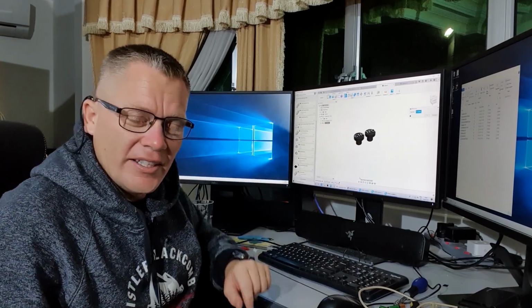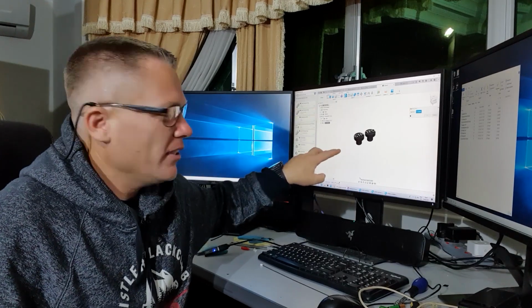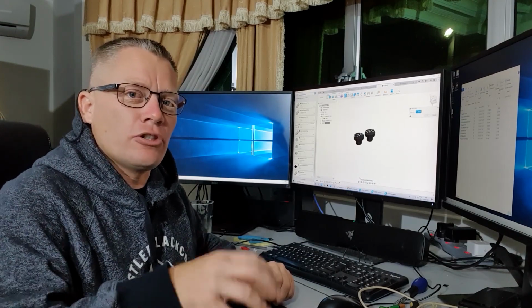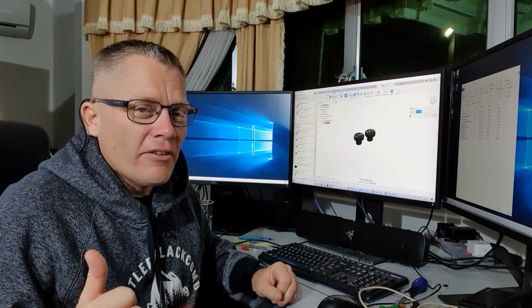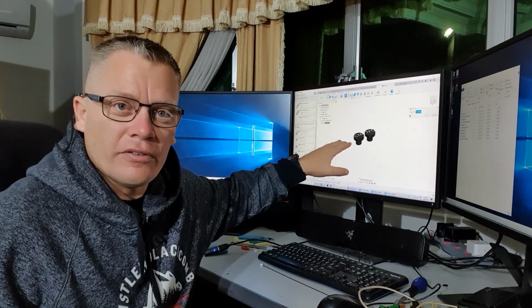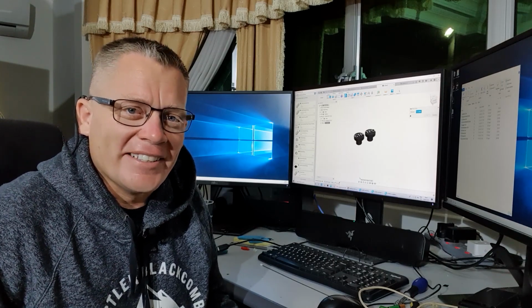first letter. Now, it's just hit me that perhaps if I print two of these, so I print four in total, and waste the first two and get rid of the blob out of the way so it starts extruding properly, that might actually fix it. I've got one on the go now, so it'll be the last attempt at what I'm currently doing, which is a filament change halfway through the process on level 37. Let's head out to the workshop and see how it's going.